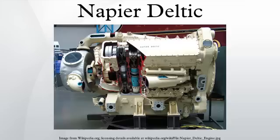The Ton-class vessels were powered by a pair of Deltic-18s and used an additional Deltic-9 for power generation for their magnetic influence sweep. The Hunt-class used three Deltic-9s, two for propulsion and one for power generation, with a hydraulic pump integrated to power bow thrusters for slow speed maneuvering.